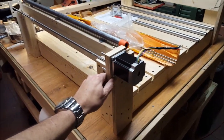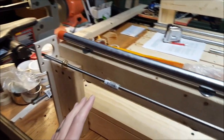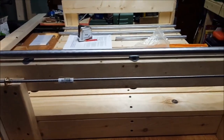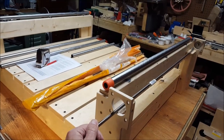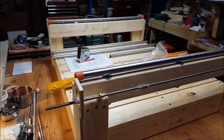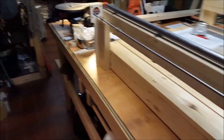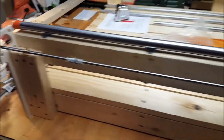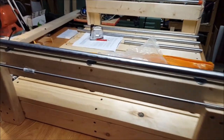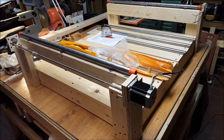The holes were made a little bit larger so we've got some adjustment — I like lots of wiggle room when tightening this thing up. For the threaded rod I actually used acme rod. I ordered this online and got a really good deal from T-mart — took about a month to get here, but all of my rods were about sixty dollars and that comes with the nuts also. This should work a whole lot more smoothly, a lot tighter than just threaded rod from the hardware store. So making progress — thanks very much for taking a look.